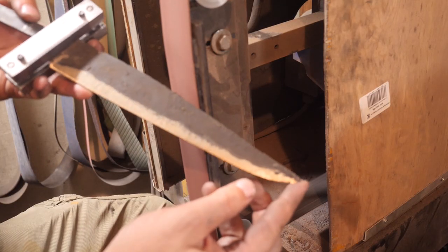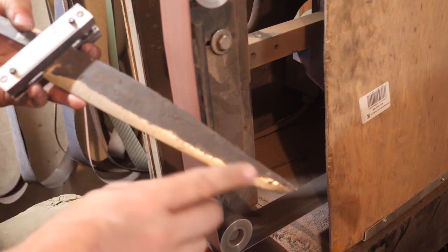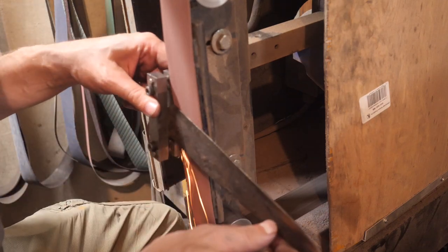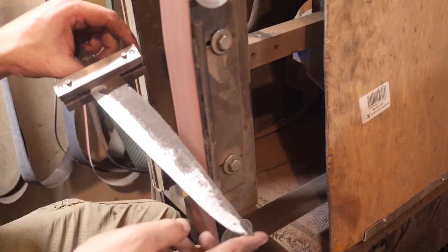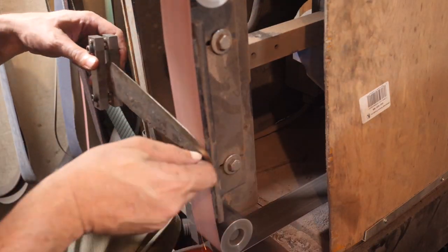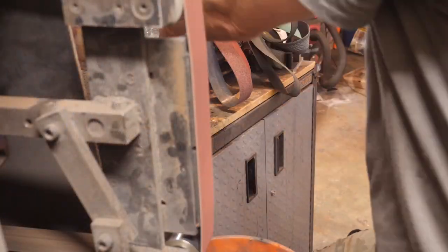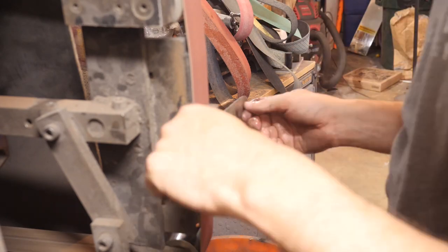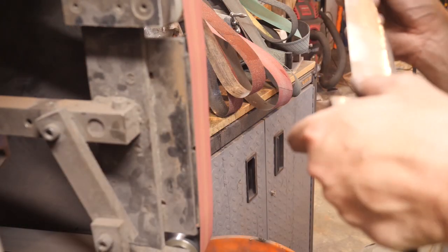All right, let's get this thing tempered. As you can see, it's nice and golden. That quench oil was a medium speed quench oil instead of the Parks 50 I usually use for 1084. I'm sort of trying out the medium oil. Again, that will also reduce things like fractures in this case. So as you can see, it moves a lot slower and the oil didn't get the knife below its flash point temperature as quickly as Parks 50 does, which is why it caught on fire when I brought it out. I'm just not used to holding it in the oil that long.